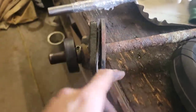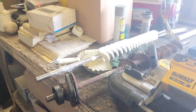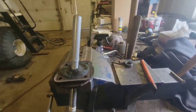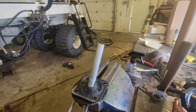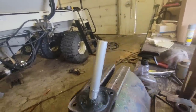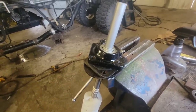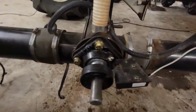We got to get this off and then slide it all back together again. I don't know about you guys, but one of my favorite pastimes is watching videos of people on the internet with no idea what they're doing — trying to put a new bearing on, wailing on it, trying to heat it up. They've just never heard of taking your time, making sure things are cleaned up properly, some anti-seize, line it up — that's how a bearing should go onto a shaft. Got that all back together again.